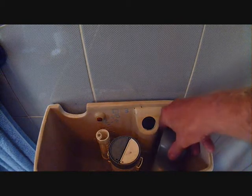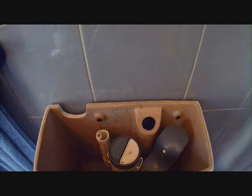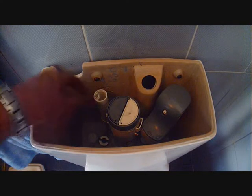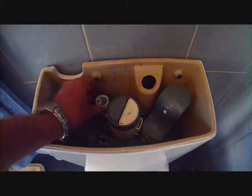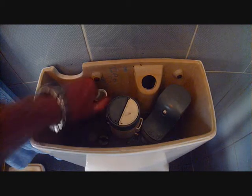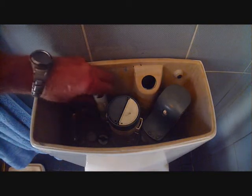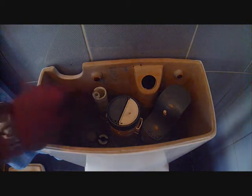I'll flush it. As the water comes up, it should stop before the outlet, the overflow. The overflow can be twisted and changed — lift up and down to whatever height you require. Twist it: turn it anti-clockwise, move it, and turn it clockwise to lock in position. It stopped well before the overflow. The overflow has to be lower than this hole, so I'll just put it down a bit lower.